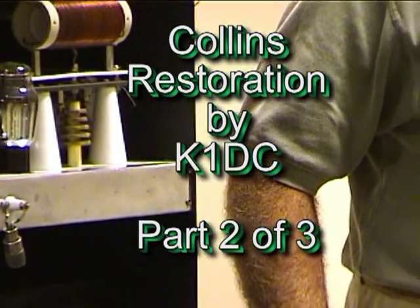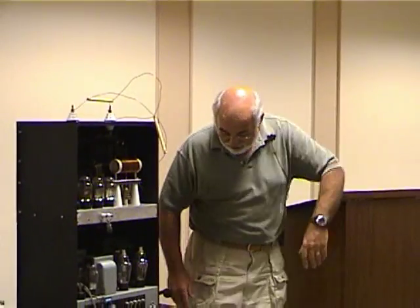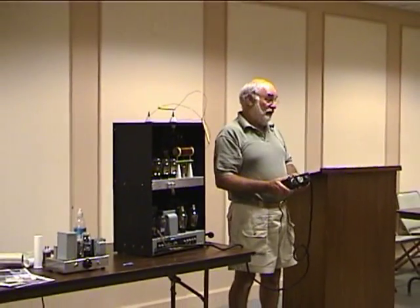Initially, probably an hour or so. I didn't leave them on long enough when I first fired it up and I blew a fuse. They arced over inside and the mercury had not vaporized yet. But now you'd only need to wait — it says on the control box to apply filament power 15 seconds before plate power.